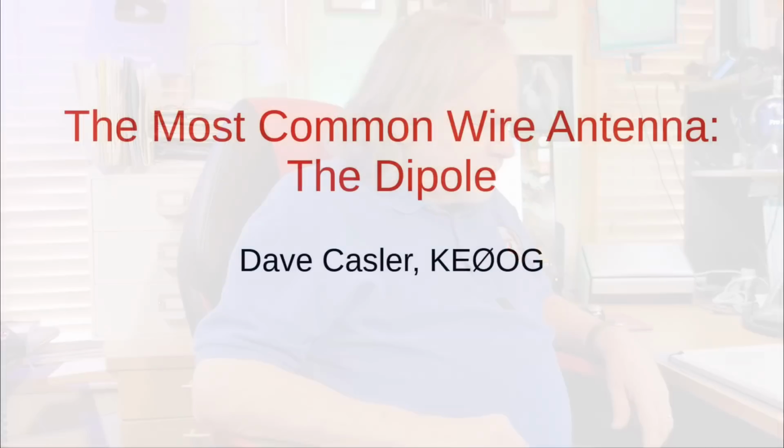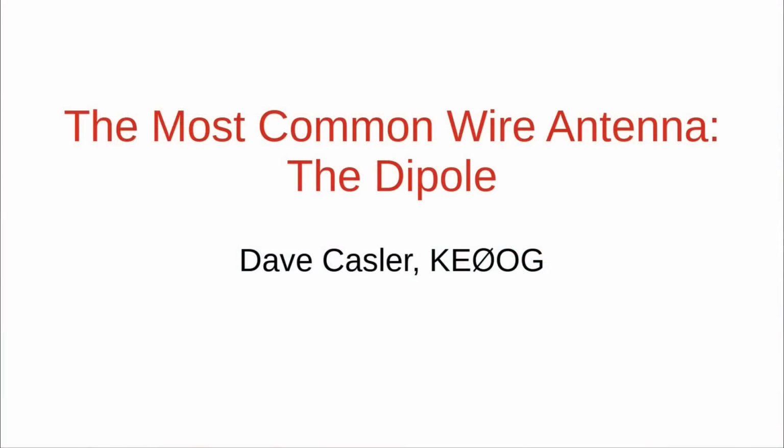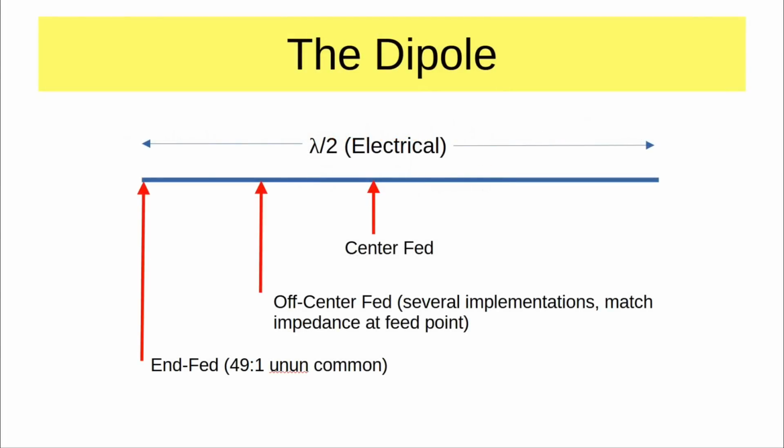With that, let me go through something here that I actually put up just for you guys. I gave a talk at Pacificon in October. It showed a series of graphs for how high an antenna was for best NVIS performance. So now let's take a look at those charts. We're looking here at a series of charts I presented in Pacificon. It started out with the dipole and ends up with good ways of creating an end-fed antenna.